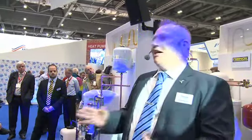So you haven't got a system that would feed the boiler for the central heating part of the system, so you're assisting... Solar thermal is not designed for central heating. It's only designed as an assist? No, it's only designed for domestic hot water, because solar thermal works best in summer, on nice warm days, and usually you don't have your heating on. Right, okay. So yeah, there are ways of doing it.